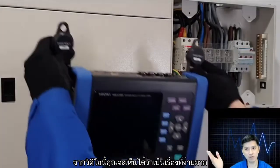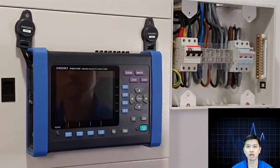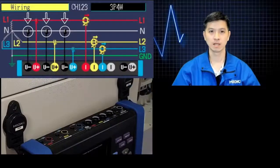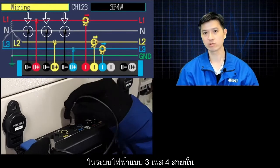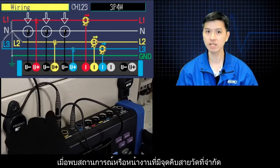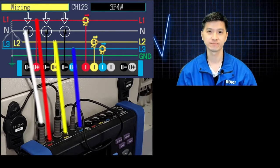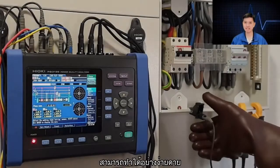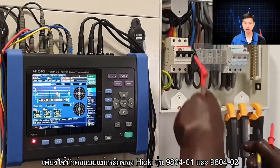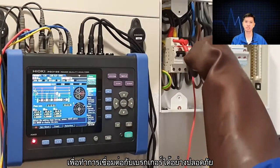In this video, you will see how easy it is to clip the heavy-duty magnetic strap onto a metal distribution panel. Shortly, we will be doing some measurements on the open panel beside the PQA. For a 3-phase 4-wire electrical system, we can use a patch cord to short all the neutral terminals, resulting in only having one neutral tapping point along with the L1, L2 and L3 terminals. For the connection process, it can be made easier if you use the Hioki magnetic adapter 9804-01 or the 9804-02 to plug securely into the circuit breaker live terminals, as shown.